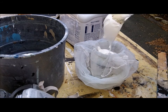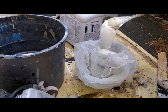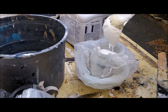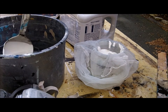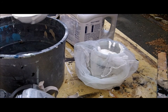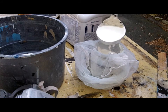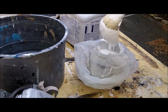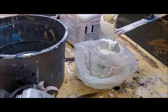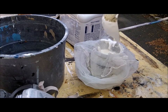The good thing about this Command Max is it's a fine finish sprayer. And because it is a fine finish sprayer, you don't need a lot of paint for your projects — I never fill my cup up. I've put in about two, almost two ladles of paint, and I'm going to put in this ladle of water. So right now, that's approximately a two-to-one ratio.